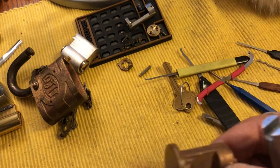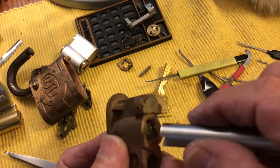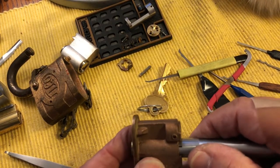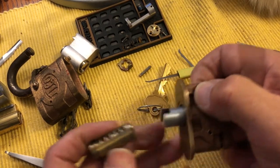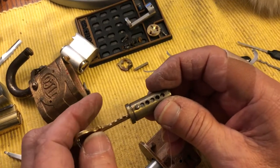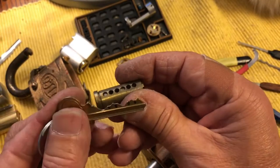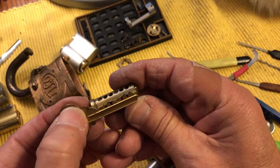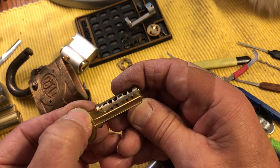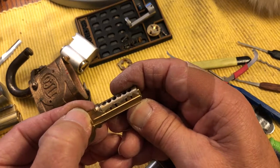So you come in here with your follower. We don't have a key yet, so we won't put the key in it. Once you're at this point, you could stick your key blank in there. And what I do is I put my key here — I've marked the spacing. You don't have depth yet; that's what you're trying to figure out. But you do want to get your spacing right.